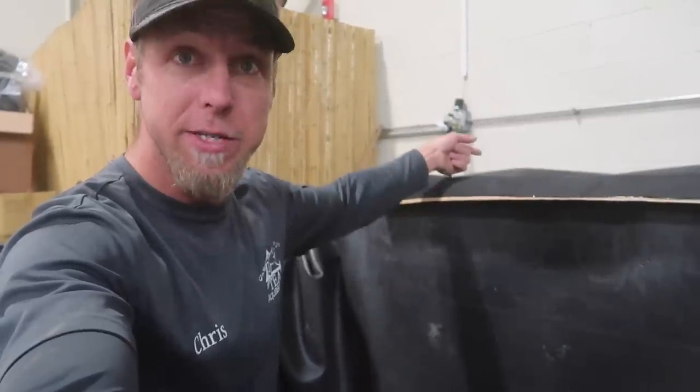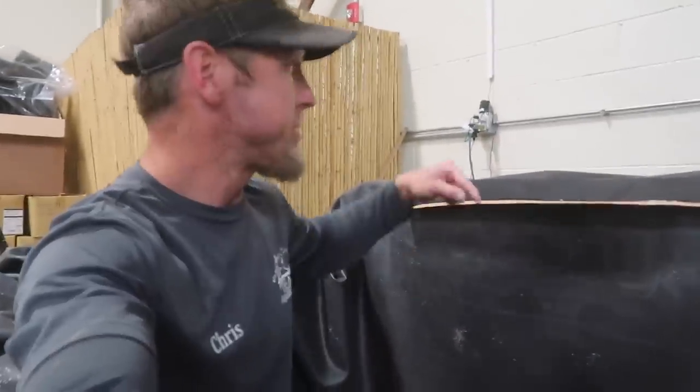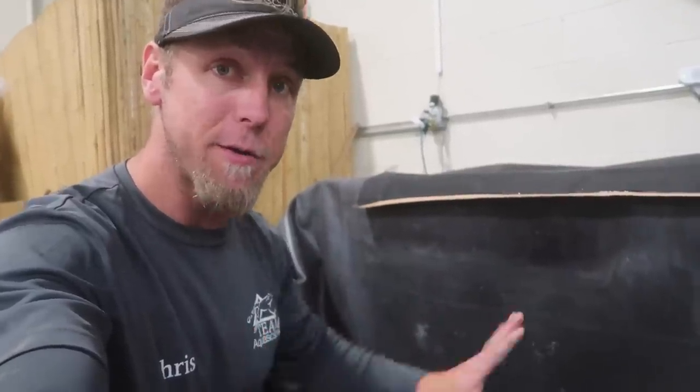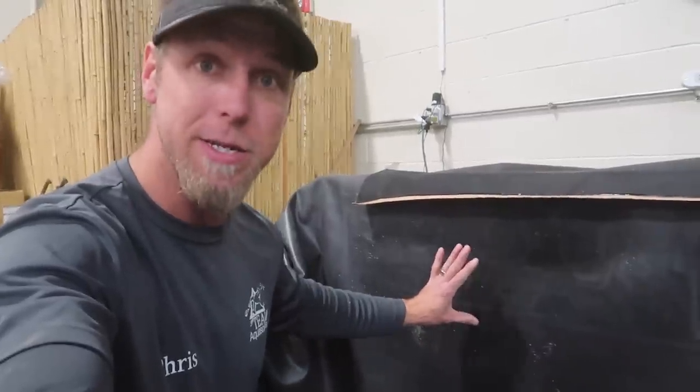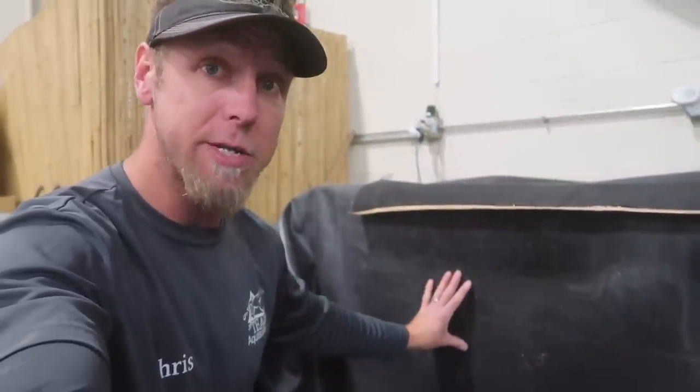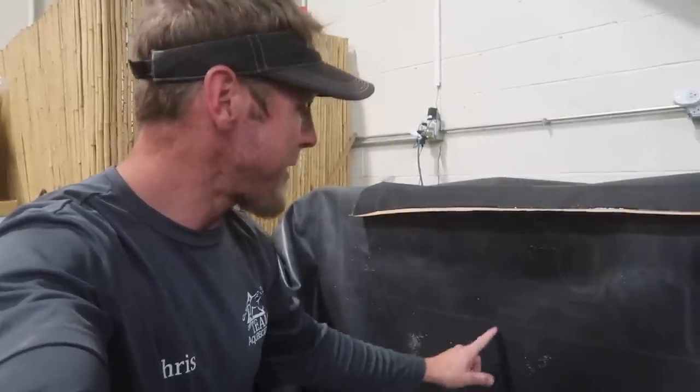I will do the same thing on the other side inside our pump vault, which is just back behind that liner that's strapped up behind. We want to take our time with this, make sure the surface is prepped nicely so it's clean, it's dry, primed really, really well. I'm going to use 12-inch cover tape today. I will trace out where my bulkhead fittings are going to go. You can see the little circles of the four holes that we have drilled in there — these are our Firestone primer. Go ahead and get some fabric in there, and then we'll just start to apply.